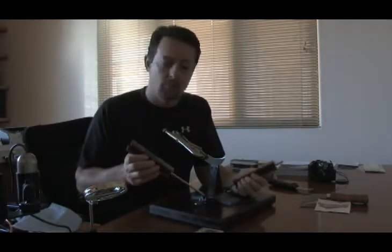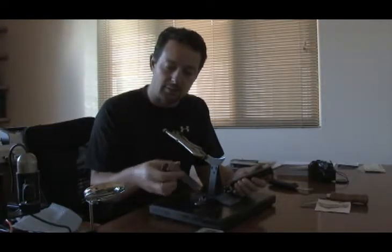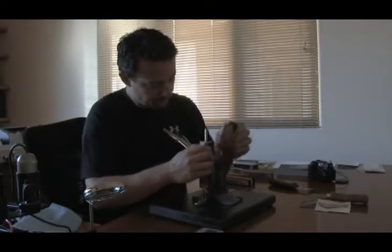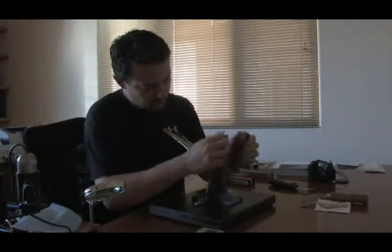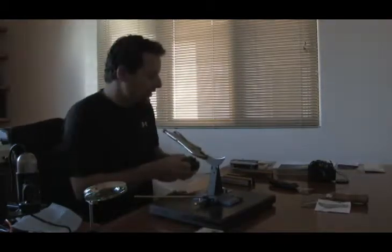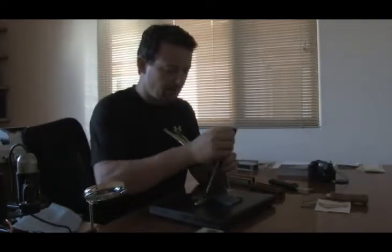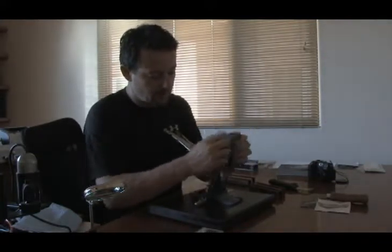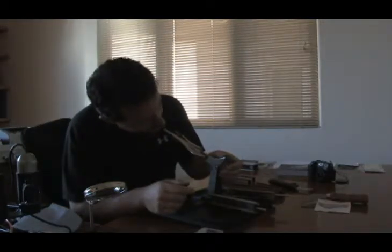So now I've got the regular strops that we've been selling for a long time. On this side they've got a 14 micron diamond paste, and on this side a 10 micron diamond paste, and I just go right after it like this. Switch to the 10. And then depending on just how much polish I want, I can go ahead and go to these, which are the 5 micron and 3.5 micron strops. So I'll throw these here in the clamp. Do a few strokes with the 5s, switch to the 3.5s. Do a few more strokes, and that looks really good.